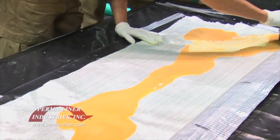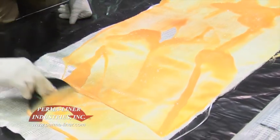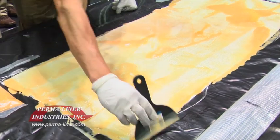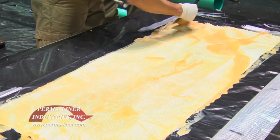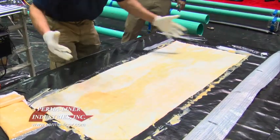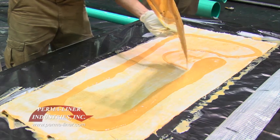You can see that Doug has just eyeballed this and poured out a liberal amount of resin onto the mat. If he didn't pour enough, it's okay — he's got plenty of time and he can go ahead and pour more if he needs it. The way this resin reacts is that when it's in mass, it's actually going to generate more heat and react faster. When it's in more concentration or you have more physical weight of the resin sitting on top of itself, it'll generate more heat. But as soon as Doug pours that resin out onto the mat and starts spreading it, unlike epoxy, this resin will actually cool back down. Now Doug's flipped his mat over. He's going to pour out the remainder of the resin on the actual felt backing on the back of the mat and spread this out to evenly saturate it and ensure that he gets a solid wet-out surface.